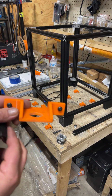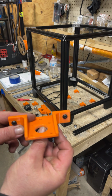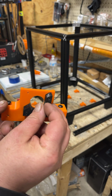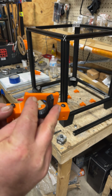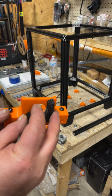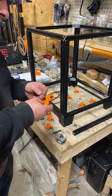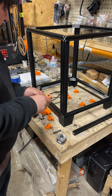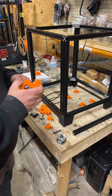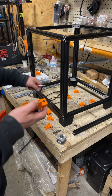And so with this spacer, it's much easier to start the bolts, which are going to be 3 M3 by 20s. And as you can see, it'll line up here, and it'll have an open spot over here. I'm probably going to make a bushing and put it in the file kit on the group page. That's 15 millimeters thick, just so you can put the extra bolt. It's technically not needed. Vorons run with just 3 bolts in their X and Y steppers all the time. And I think the Mercury 1.1. So basically, I'm running my bolts down through.